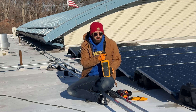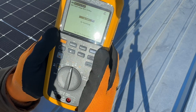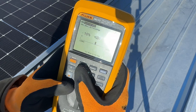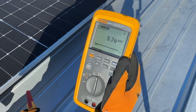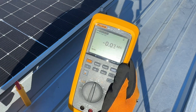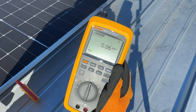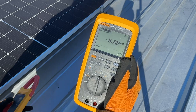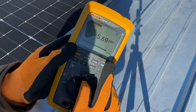The other feature that I think is new to this is the limit gauge. You set your meter to amperage or voltage, whatever you're measuring. If you've got 20 strings to measure voltage on and you're just looking for a general window, you can set a voltage or amperage range between specific numbers or percentages of a value you pick. So if you're looking to see if a string is within 5% of a specific value, it will beep when it's out of range — a nice audible reminder when you're not looking directly at the meter.